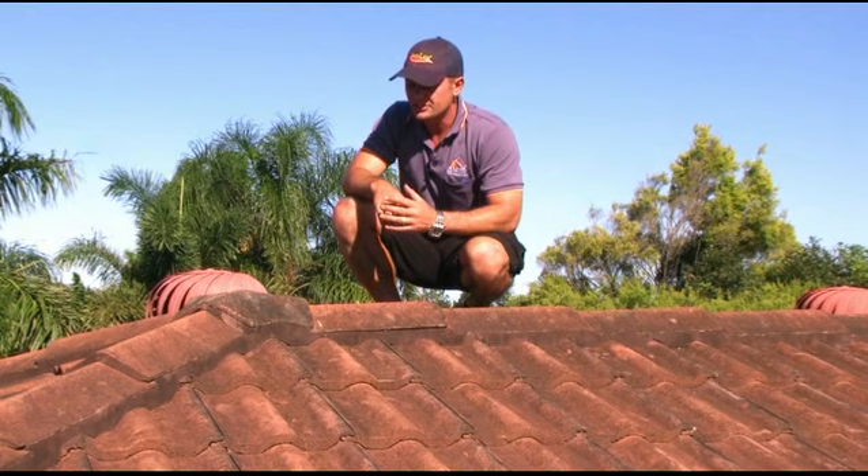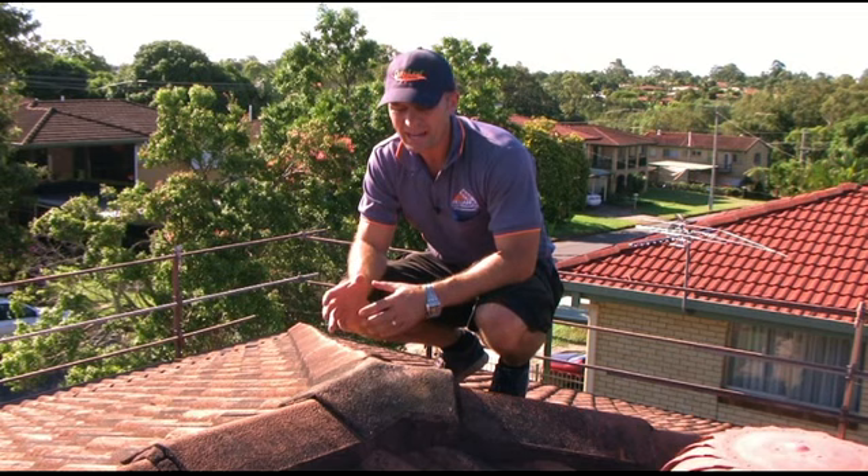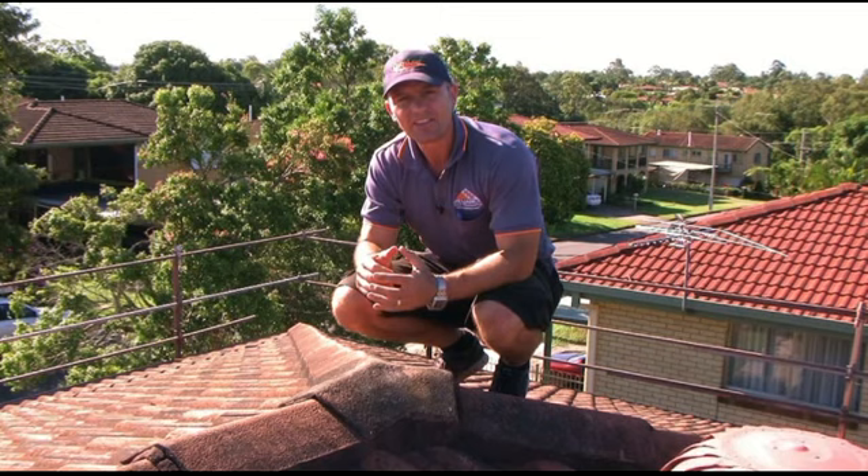You want to make sure that yours aren't like that. In a big storm, a big gust of wind for example, could remove that cap and blow it straight off the roof. So what we've been talking about so far is the security of the roof, mainly with the pointing. But there's another component to what secures the ridge caps to the roof, and that's called the bedding.